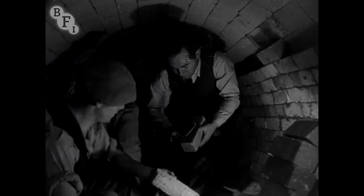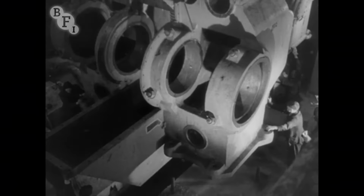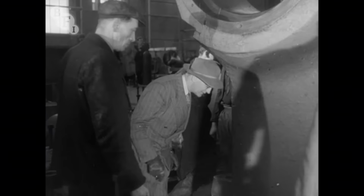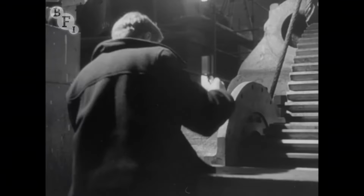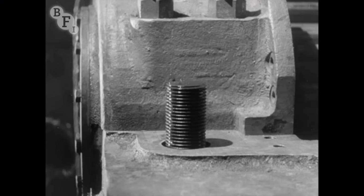All down the line of the mills themselves, throughout 1950, machinery was coming in. Onto specially prepared bolts, ready mounted in the foundations, every piece of machinery must be lowered exactly. The position of each of these bolts must be right to within a 16th of an inch in any direction. When the whole 60 or 70 ton casting is in place, it must not be possible to slide a playing card between it and the foundations at any of the support points.